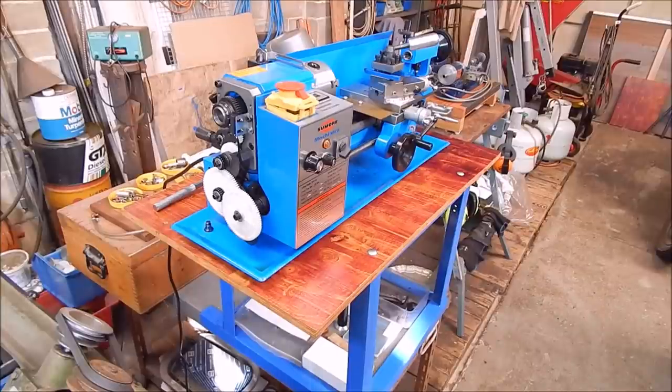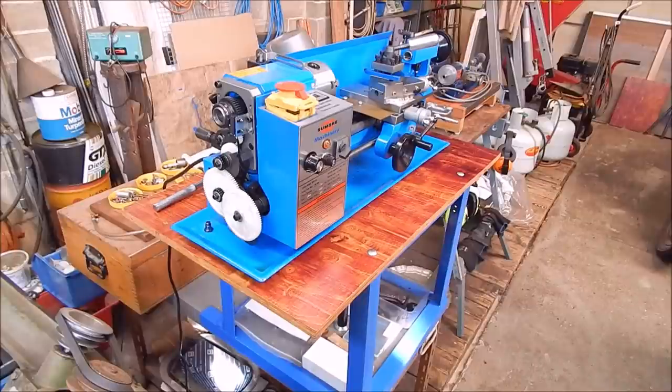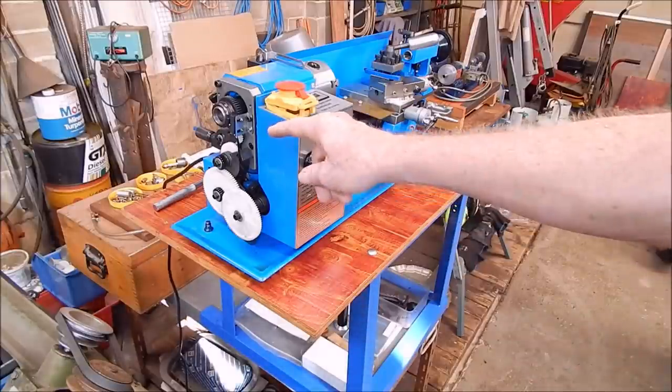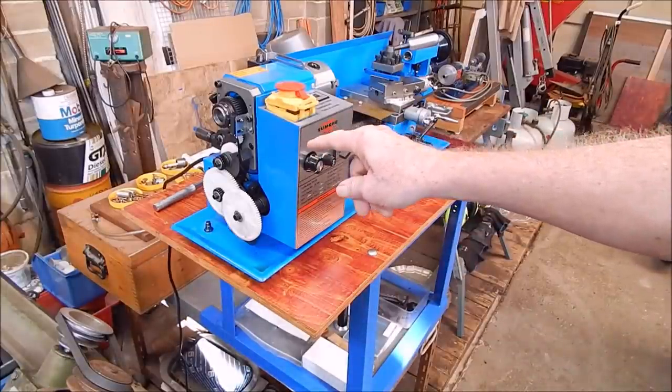So what do you do? Well, I can make up a module one gear, no problem - I've made them for my other lathe plenty of times. Had oops moments before, over-pushed, over-stressed a little thing. Or you could do what most people would do who probably can't make gears - they're probably not set up for it, it's a bit of a specialist field - they'd go and buy some. So you know, there's the option: do you buy a nylon gear like you've got, or do you get some metal gears?